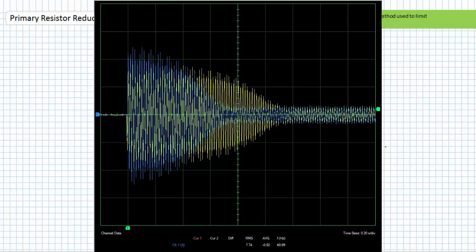In contrast, consider the graph of line current for a 5 ohm primary resistor reduced voltage starter used on the same lightly loaded motor, with the same scales of 5 amps per division and 0.2 seconds per division. The motor now takes about 1.2 seconds to accelerate the applied load, and current draw peaks at only 9 amps. Here's both curves superimposed — the full voltage starter in blue, characterized by substantial inrush and brief acceleration; the 5 ohm primary resistor starter in yellow, characterized by less inrush and longer acceleration. Increasing the resistance further will decrease inrush and increase the acceleration period.